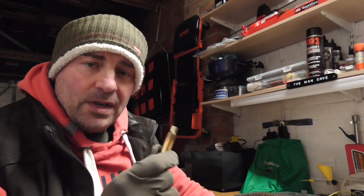Okay, so now that the cases have been neck turned, the next step, just with the necks, will be to close the diameter of the neck now to our bushing size. I use a bushing size, if you use a neck sizing die. But I shall be running these into my die, and they will give me the diameter that I'll be setting these at with my bushing. I'll link that onto the next video.